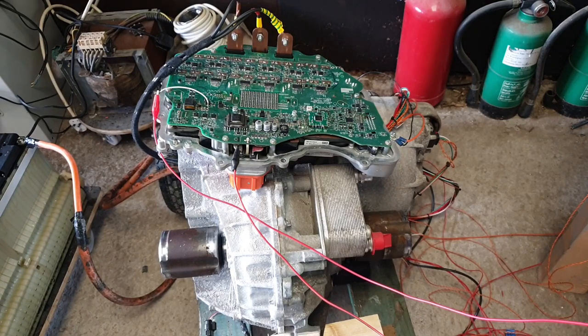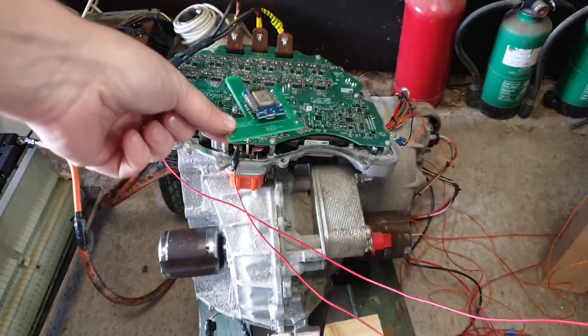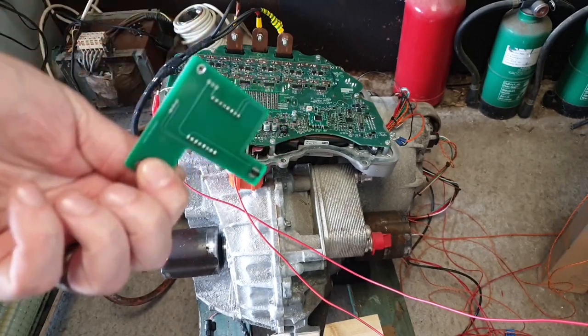There have been some really good developments around the Wi-Fi module side. We now have a functional CAN bootloader for the OpenInverter project and the STM32, so we can do software updates over CAN. Dave has been working on a CAN control tool that does everything the Wi-Fi can do, just over CAN. Someone on the OpenInverter forum is also working on a CAN-to-Wi-Fi bridge, so the Wi-Fi module doesn't have to be directly connected — it can be anywhere on the CAN bus inside the car. Really good developments.